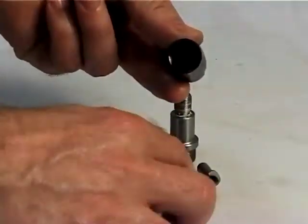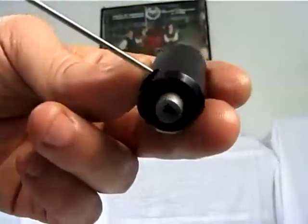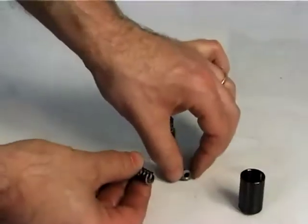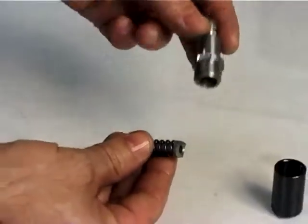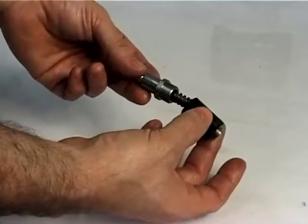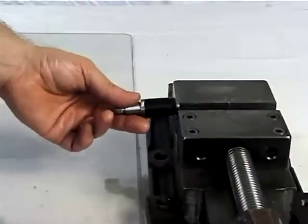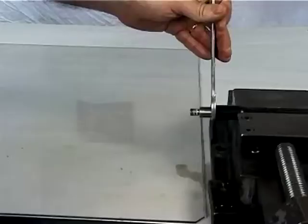Remount the 3 clamps inside the cone so that their position corresponds to the position highlighted. Insert the spring, figure 18, into the clamp opener, figure 19, then insert these 2 parts into the cone holder, figure 20. Screw the cone holder on the clamps holding cone, figure 17. Fasten the screw in an adequate vise and clamp it using a 17 mm wrench.